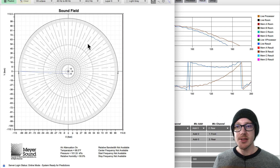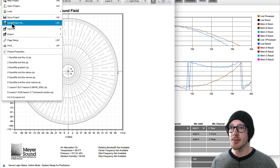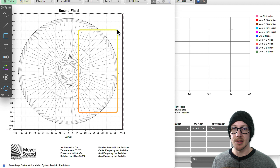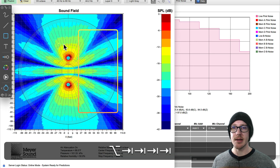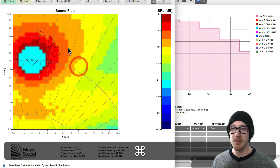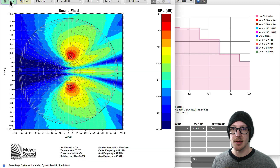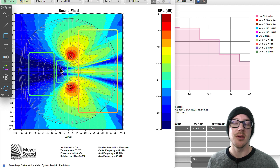So why are we doing all of this? Dave talked about trying to limit the amount of interaction in the middle. Let me show an example. I have one called stereo — imagine some kind of audience playing here. Starting with just the two rear speakers, this is going to do a prediction of a normal left-right stack: summation down the middle, and then cancellations on the sides. Using this arc array instead, I have them aimed out at 45 degrees.